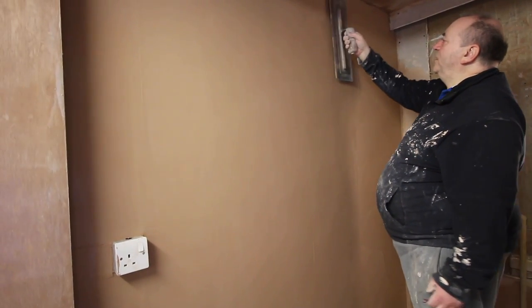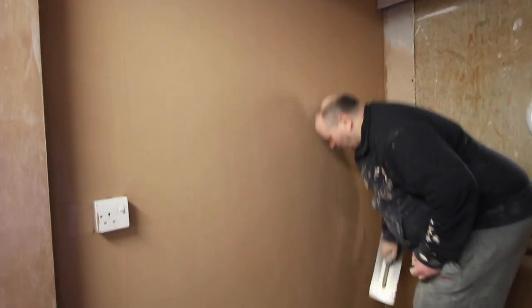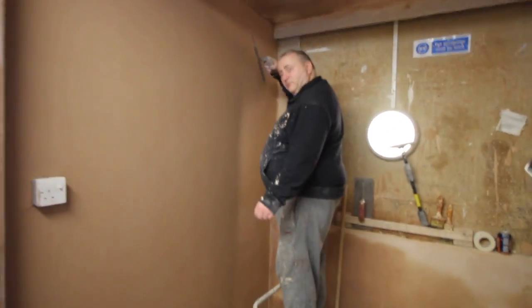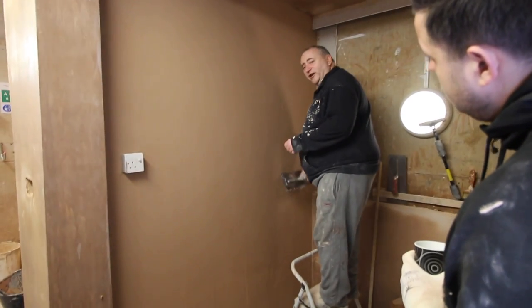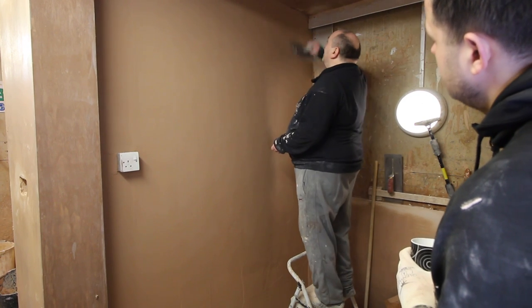See that hole up there, a bit of stuff in it, nice and tight, right down, rounding off. And as you get closer to the wall, you can't turn the trowel off, you just got to gently glide it off. If you do it firm and then slow down, you shudder it at the end, which isn't what you do. You just got to bring it off.